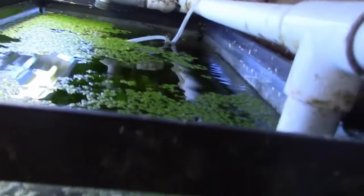Now, see the pipe going up? That pipe is going all the way up to the top row, where there's similarly an overflow. The water comes out a siphon, siphons down this U-tube, and then up to the level of the bottom of the T, and drops down. You saw where it drops to. I'm going to explain the valves a little later. We have valves on each one.